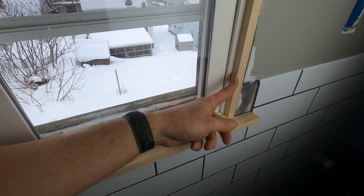So, if these two doorways weren't as close together as they are, say they were 4 feet apart from each other, I don't think I would have had to change the thickness of that board. But because they are so close and they're actually touching, if I hadn't changed the thickness to match the height of this one over here, I think it really would have looked like an obvious mistake.